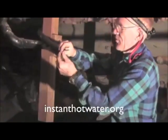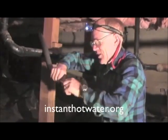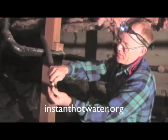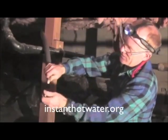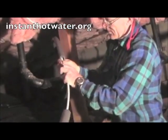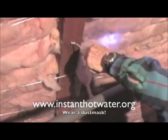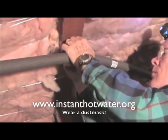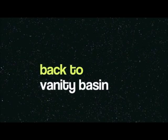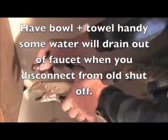And it's important to put the fat end on the pipe first, so that the thin end faces into the T. So the skinny end of the washer, it's a tapered washer, the tapered end faces into the T. So you shove it in, make sure it's up the pipe about 1/4 inch. Put that together and, okay, now let's see here. Yeah, that's about right.